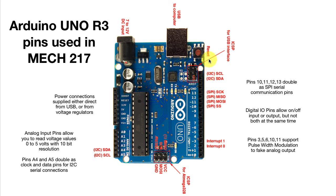First off, it's a standalone microcontroller. Once the processor is programmed, you can start it running just by applying power. That power can come from a USB connector connected to a computer, a battery, a USB charger, or an AC adapter — one of those wall warts — with a voltage of 7 to 12 volts, which will be reduced down to 5 volts by this regulator here. You can start the program by applying power, or restart it by pressing this reset button, which starts the whole program over again from scratch.